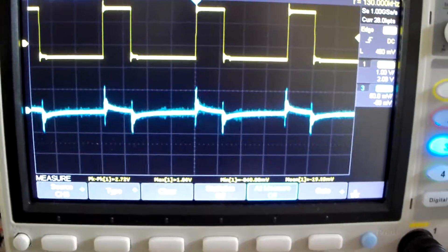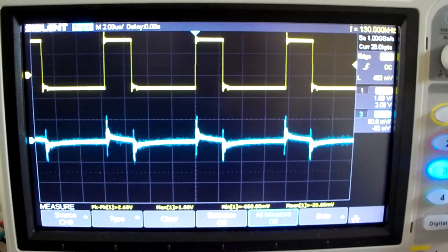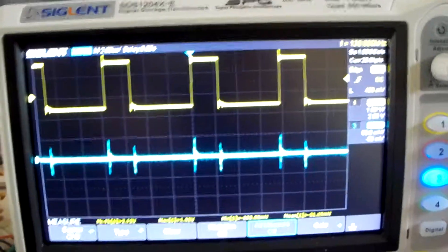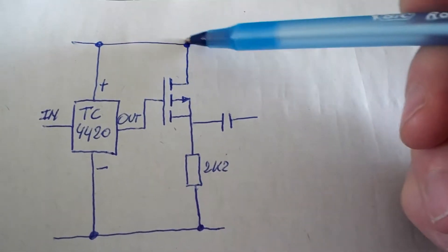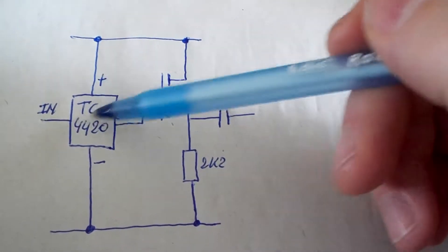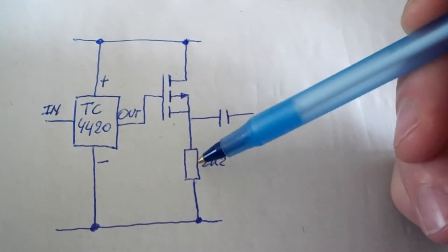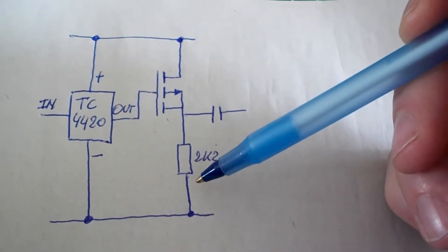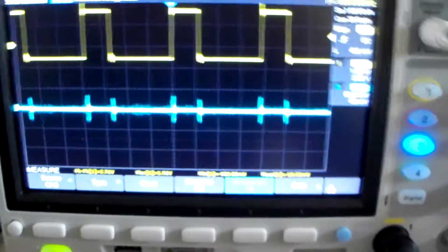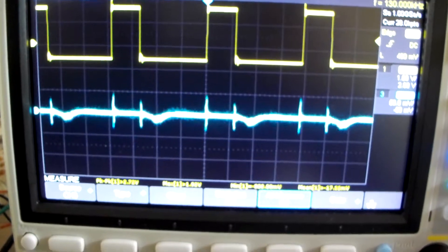This is the signal that is coming from the signal generator and going to the MOSFET, then measured on the resistor. If you look at the circuit, this is the situation at the moment. This connection is not yet connected to the 12V — the gate driver is, but the MOSFET not yet. We measure with the scope on the 2K2 resistor. This is the signal without the power connected. Now I am connecting that power.